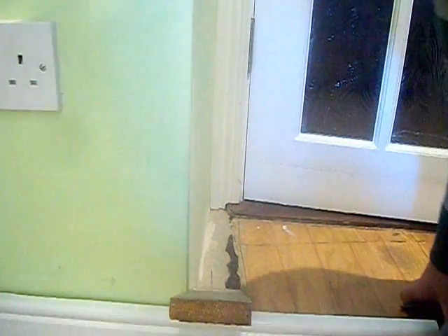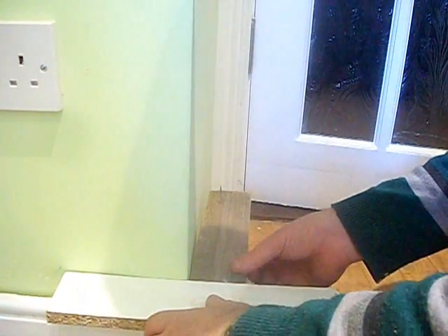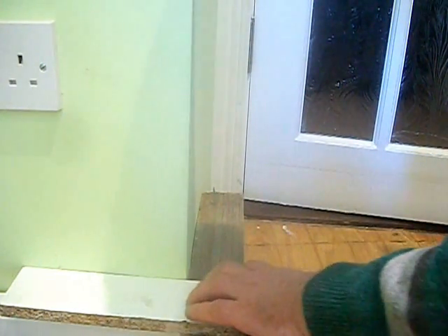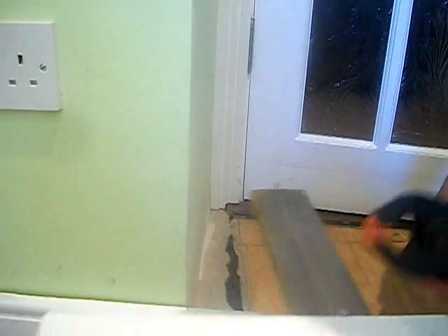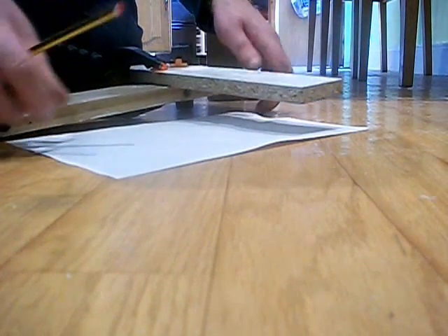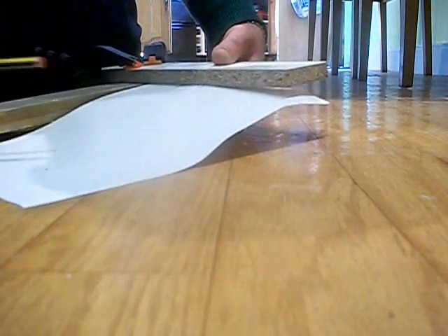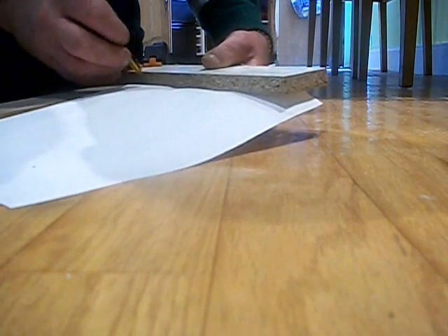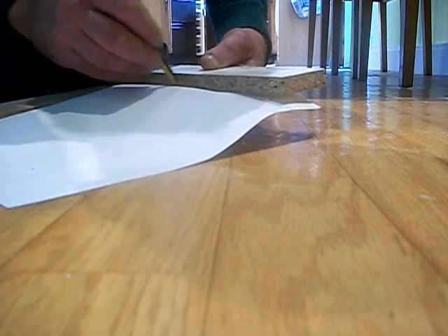Here's a wee tip. Most people wouldn't do this — they'd just guess the exact angle. Just put two bits of wood up against the wall like that and clamp them. Throw a wee line on the back just in case the wood slips. Put a wee clamp on there to stop it moving. That's our angle now — the exact angle of the wall. This will be near enough to the nearest degree or two, and you can always check it once you've cut.